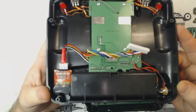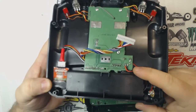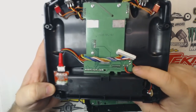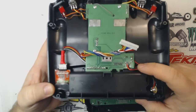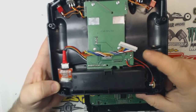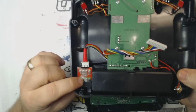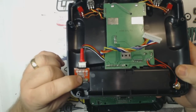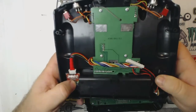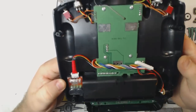Now, if you're interested, I do have other videos on how to mod this particular transmitter. I have a video for a LiPo mod, just like I've done with my Flysky GT3B. I've also modded this one to take a 3-cell 2200 milliamp LiPo, and you can look up my video on my channel for that if you're interested. And just like I do in my Flysky GT3B, I also have mounted a low voltage checker for the LiPo battery, so I know when it's getting low. I believe this particular one alarms at 3.3 volts per cell.